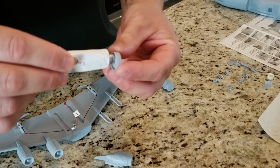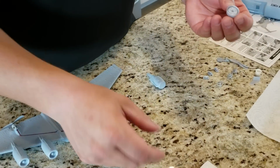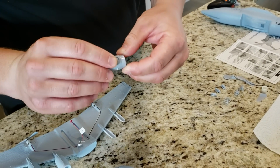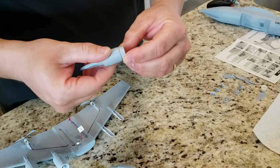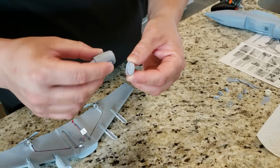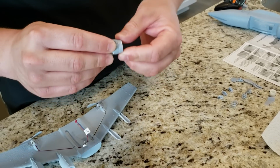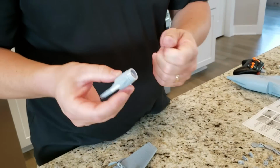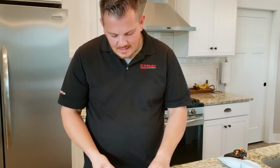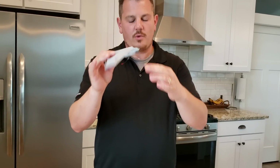And I just kind of put a little bit of that glue in there. Same thing. Come in, get the face of that glued up, peel it, spin it, just like that. That'll kind of activate that glue. And the second or third time, you're not going to peel that out of there very easy. Okay? So now we need to get those into the rails.